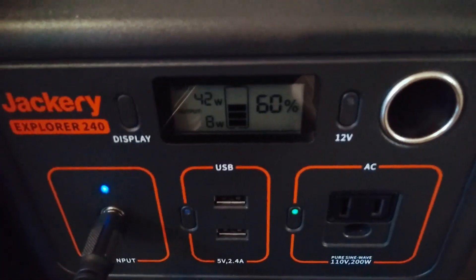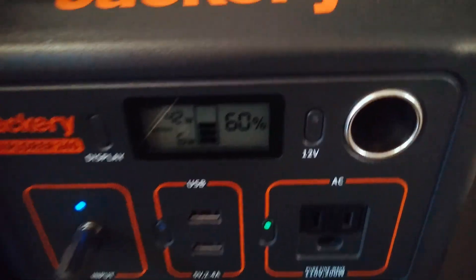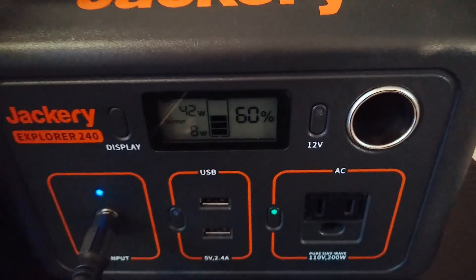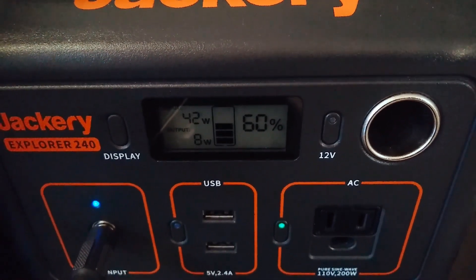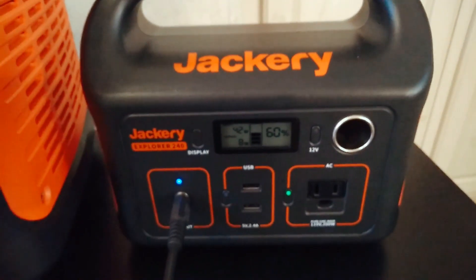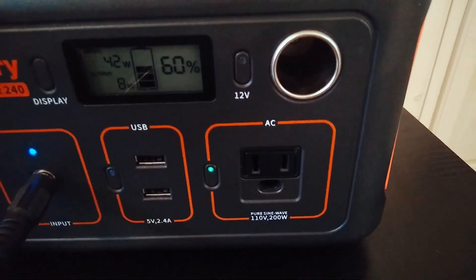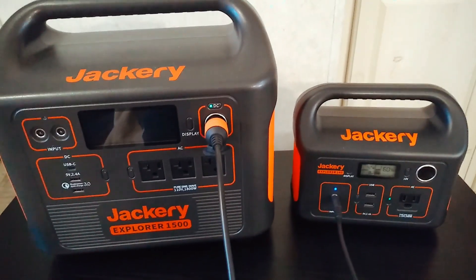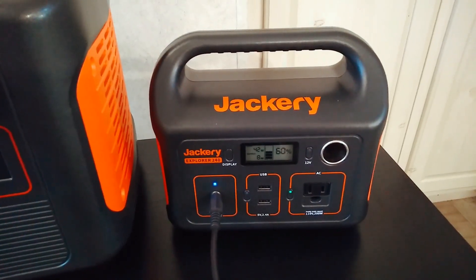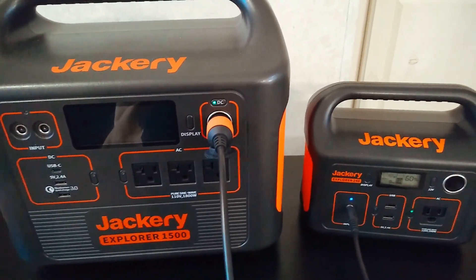In this case it's coming in at 42 watts. If it's going to be going out somewhere around 42, you're not going to even lose any capacity. But even if it's like 50 or 60 watts, that percentage will just very slowly go down and you can get hours and hours of run time on it. It's just going to be much more efficient because you've just got this little inverter powering a small load. Just something I like to do with these units and why it's actually nice to have a small unit on hand — for small loads, it's just going to be much more efficient. Hopefully someone finds that interesting or helpful. Thanks for watching.